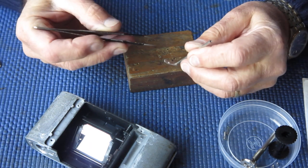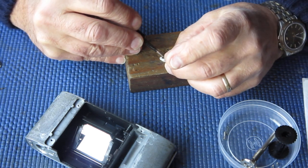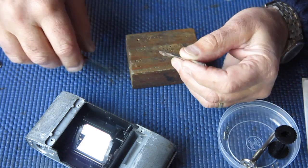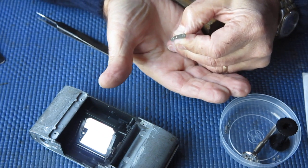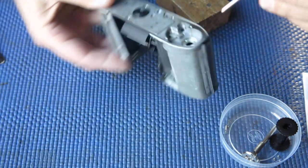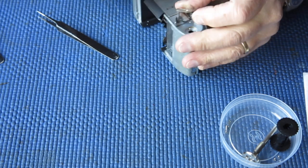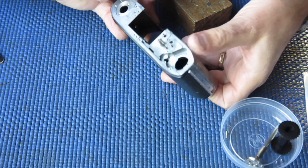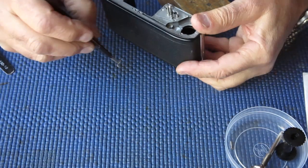So basically, I've got to get the spring hooked around that boss there, the coil of the spring. Here it is, it even went without a fight. That's the spring there. That fits in this hole in the body. Just checking it's tucked back neatly. I'm holding that in place with my finger from below so that it doesn't get away.